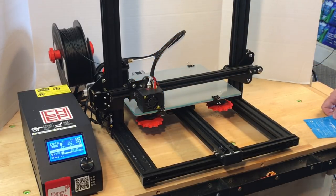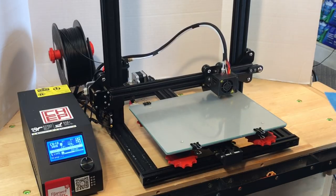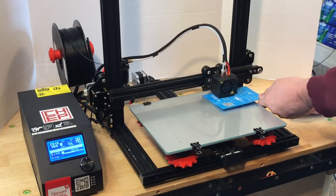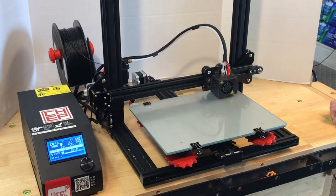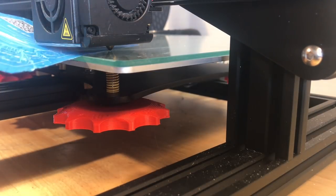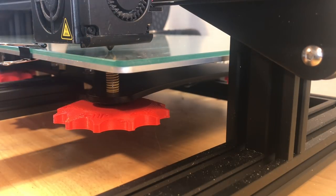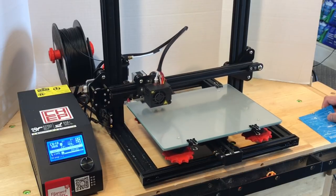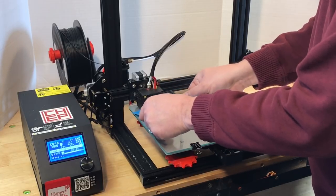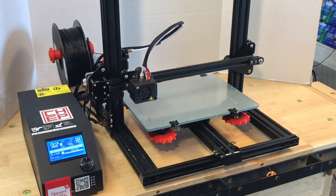If I do it to the outer edges I tend to not get the level that I really want. Now it's going to go to the back corner and land on top of the screw back there. To me this is a little more accurate than what he had, at least in my opinion, and this is the way I tend to adjust the bed. Here it is — you can see it lands right on top of the screw head and spring. Now if I adjust this I'm actually adjusting directly below the nozzle. I like it this way better. It finishes by going to the back corner just like before — slide the piece of paper in and this feels really good. My bed is perfectly level and then it just lifts up, stops, and disables the steppers.